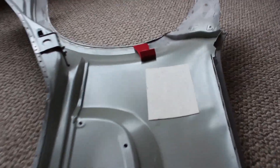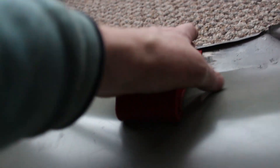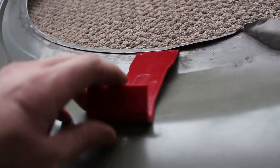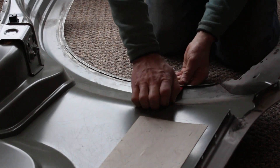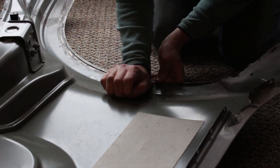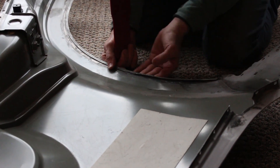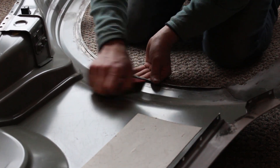So this is the panel — the used quarter panel that I'm going to put on Colleen. I've got to run this round, bend it up slightly all the way around, and that's what's going to wrap around the inner wheel arch. I'm going to put the panel around inside, but I've got to go around and bend this all up. The adhesive that I've bought — it obviously went on a shelf for too long, it's gone off, so I've had to mix it by hand.